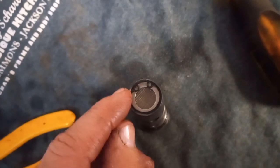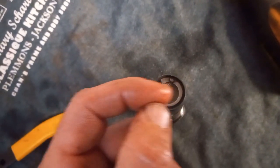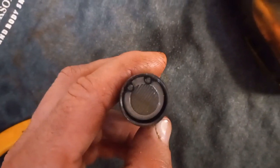Now when you're putting this back together, you're going to have it stand straight up, and you're going to have to be loading that spring. You're pushing it down. You're pushing on that filter screen. Be certain that you're able to push that internal clip beyond the groove so that it comes up and snaps in. See, that O-ring that's right underneath the screen likes to get caught in the groove for the snap ring, and you're trying to push this thing down, and it's going most of the way around. It's going down below, but that spot where there's a little bit of rubber O-ring in the groove, it's going to take up the groove so that you can't get that E-clip or circle clip, whatever, that snap ring. You can't get it in the groove because the rubber is taking up its spot. If it doesn't look like this, where the E-clip is mostly out of sight because it's in the groove, then it's not in there good enough.